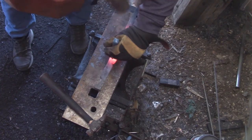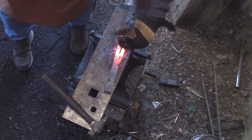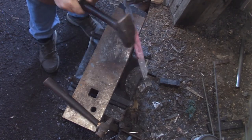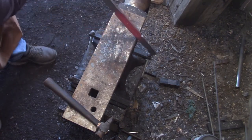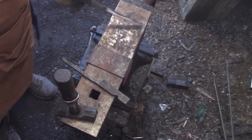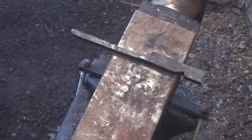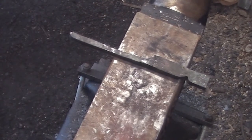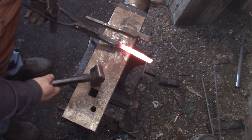I did cut the reins kind of short on these, but as it turns out, I'm kind of glad I did, because these are designed for a bigger piece of stock — three quarters to an inch, give or take a little bit. I think I have more control. They're only about an inch shorter than the other ones, but even that, it's better just to hold on to them. I think if they were longer, they'd be harder to hold straight horizontally because the tongs themselves have a little bit of heft to them.